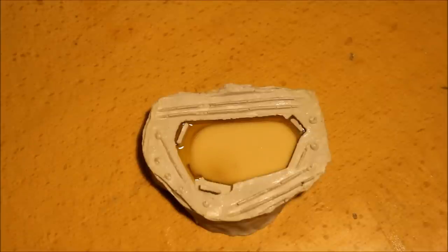The reason why this happens is that polyurethane resin is actually an exothermic reaction, which means it gives off heat. When you have a lot of it together — a big volume — it gets really hot really fast, and the hotter it is the quicker the reaction is, and that's why it flash cures.